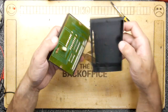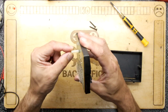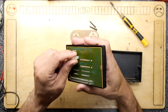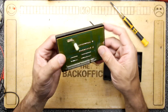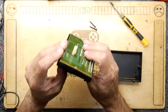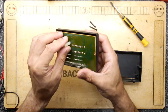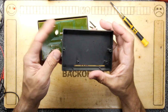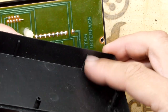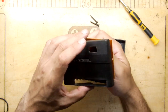The first thing I've noticed is this rather shiftily glued-on standoff, which I really like — this is the kind of stuff you find. Nobody thought it would need one when you're plugging in your joystick, and then they discovered that the PCB was flopping around a little bit too much. In fact, I'm pushing gently with my finger and you can see that's what it's there to prevent. It should really have engaged with these features on the plastic to stop the PCB from flexing, but maybe the PCBs are just too small.